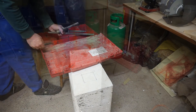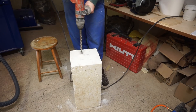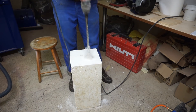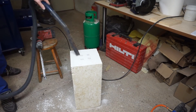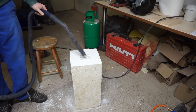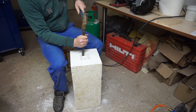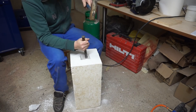With that out of the way, let's start with making the heating chamber of the forge. I used a foam concrete block — which goes under the name Ytong in Europe — because I already had one, but in terms of cost efficiency it is quite a good material to use. After cutting the block to size I started making the heating cavity. The material is very easy to work with; you can cut it with literally every tool in your shop. I used long concrete drills and a rotary hammer to manufacture the deep chamber, though you could also use a chisel and hammer by hand. Using the drill I just needed a little bit of clean up afterwards and the job was done.